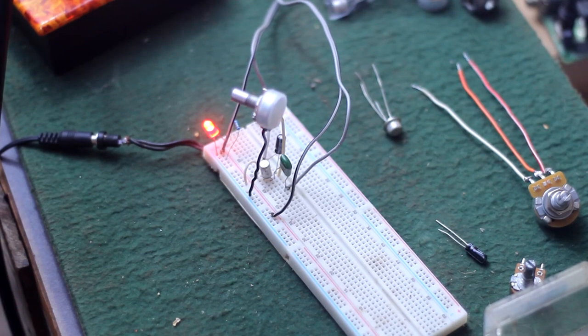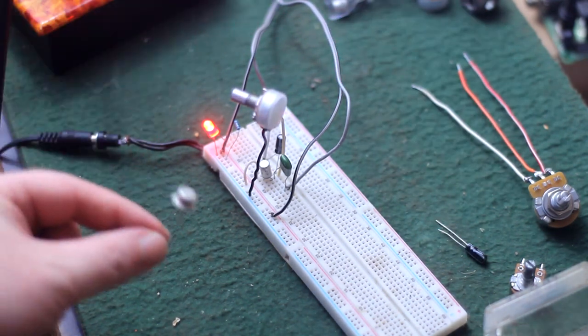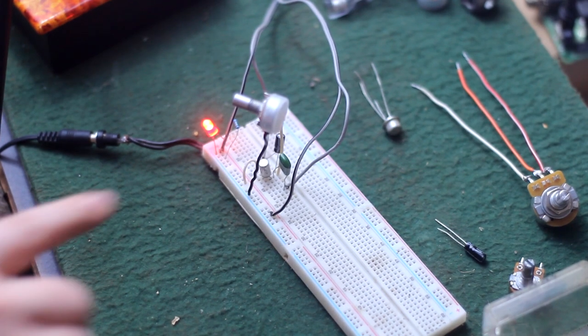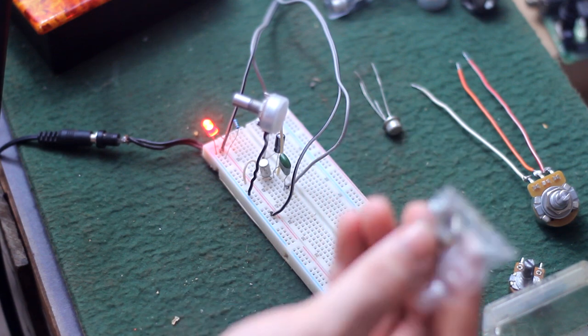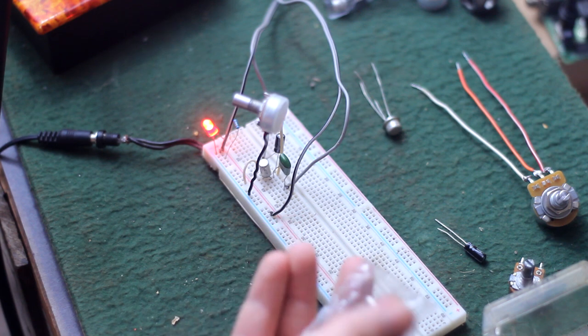Works as a great little germanium boost. But with such a low parts count, you'll really be able to hear what a transistor sounds like and how much gain it has when you switch them in and out of here. Okay, so I have the first half, the first gain stage of this fuzz face built. But I'm using these super high HFE germaniums that came out of an old tape player.